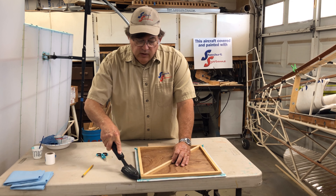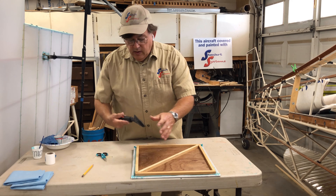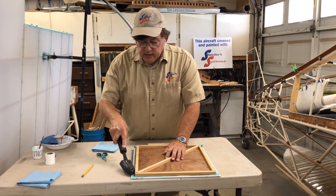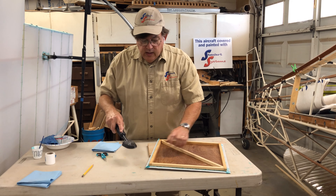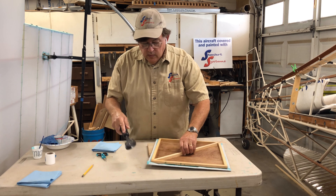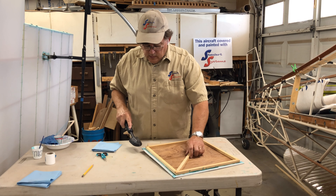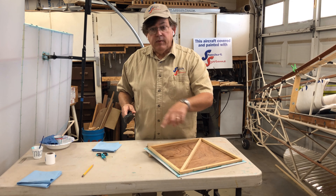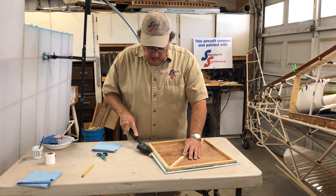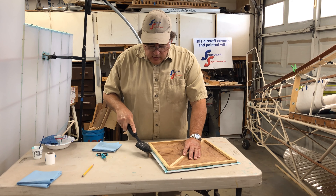You can see how nicely that laid the corner down. I prefer not to get glue on the iron, but if I do I can wipe it quickly on a paper towel. It's better to do that when it's set up, but if you're working quickly you can set the glue by putting the hot iron on it. Those corners are set down pretty nicely. Just like I did on the top, I'm going to get these edges bonded in really well with heat — applying enough heat that you should see the surface turn dark as the glue is bonding in.